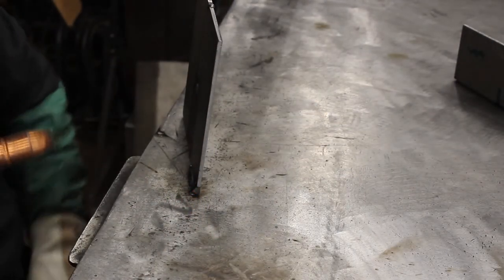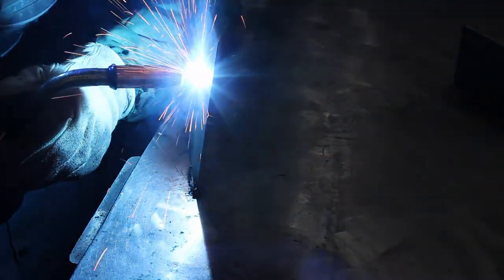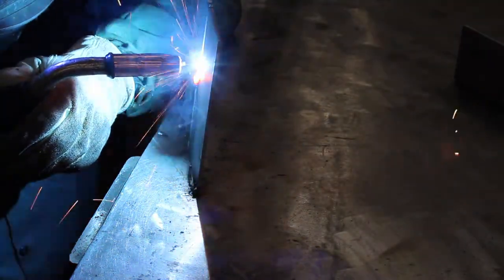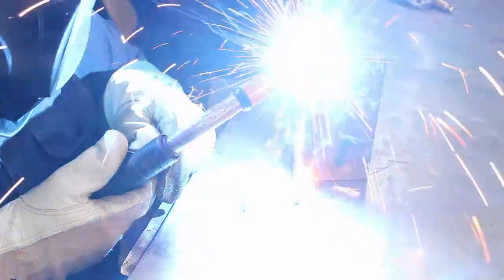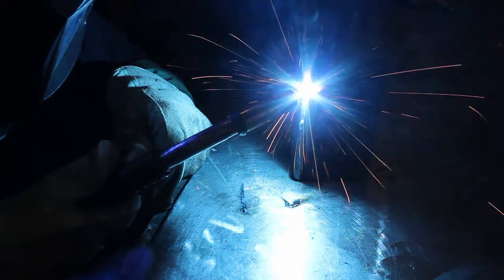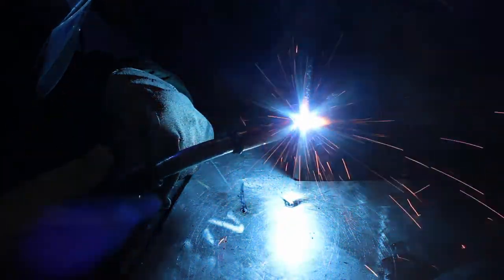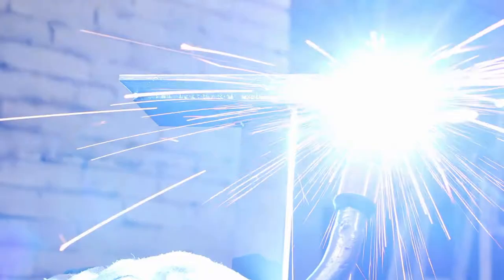Vertical positions: vertical welding — both up and down — can be difficult, making pre-weld setup very important for high-quality welds. Since you are fighting gravity, consider reducing the voltage and amperage 10 to 15 percent from the settings for the same weld in the flat position. When welding vertical down, begin at the top of the joint and weld downward. The vertical down technique helps when welding thin metals because the arc penetrates less due to the faster travel speed.